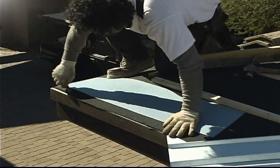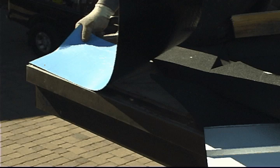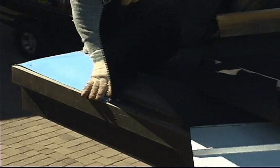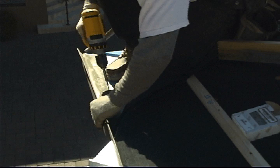Remember that eave detail we were talking about that was improperly installed? Now you can see how it should be installed right here. Bear with us a bit as the guys are doing some of this a bit backwards for this video so that we can all see it. Okay, now the eave metal's attached, and see how that underlayment laps on top of the metal. That's how it's supposed to be. With that underlayment lapped over the top of the metal, we're not going to be getting any water that goes underneath that down into the fascia anymore and rotting out the fascia, are we?